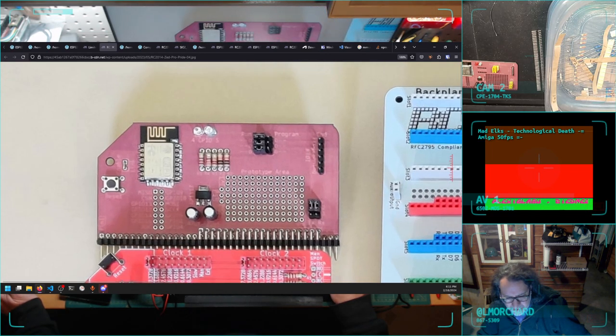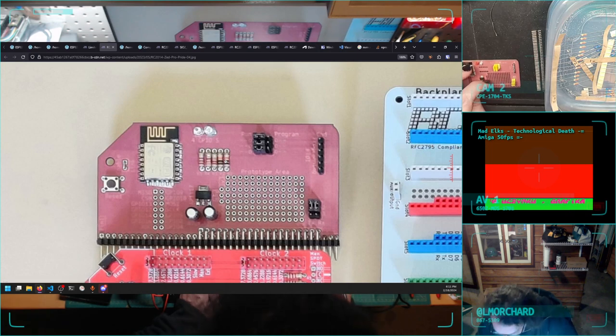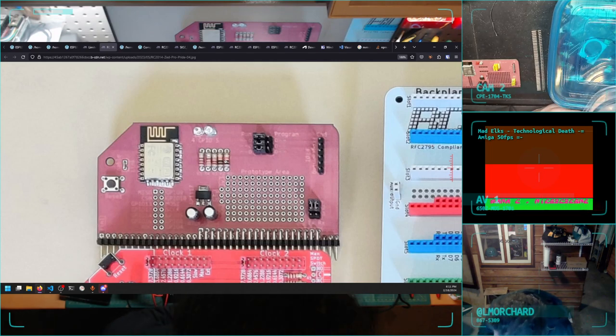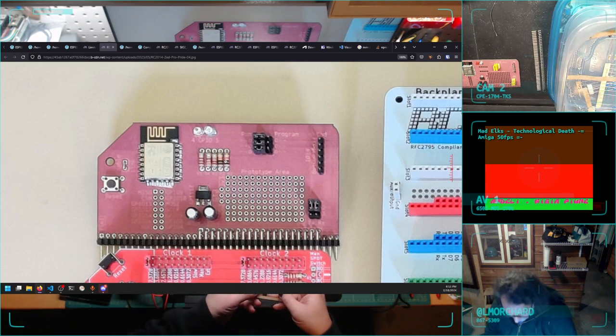Like, those look like three browns, but I'm sure that's not right. I'm sure there's like a red or something in there. But these look just like they're the same resistor. So I'm thinking on this board, they are actually both 10Ks. And I don't know that I have any 10Ks lurking around in here. So that first one wants a 2K2 and I got a 2K1 and this looks like red, gold.